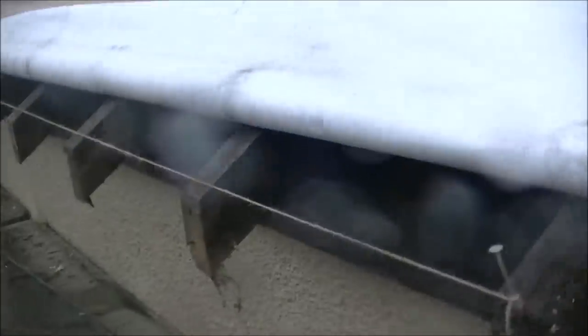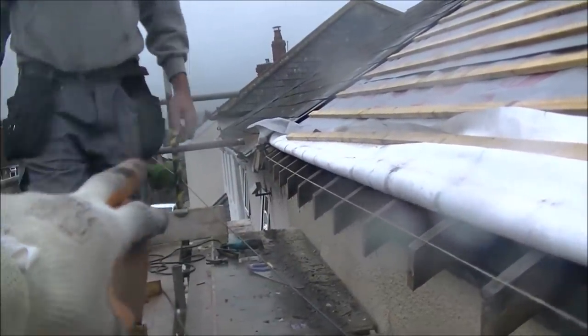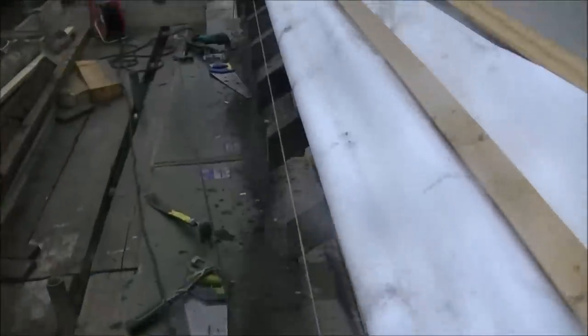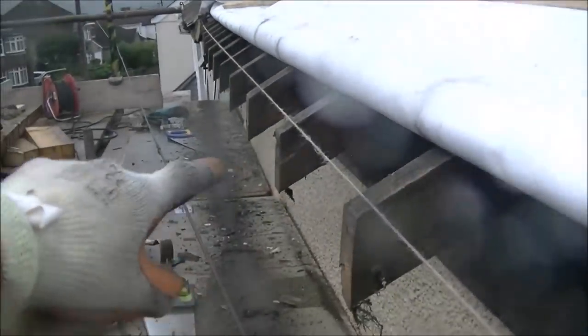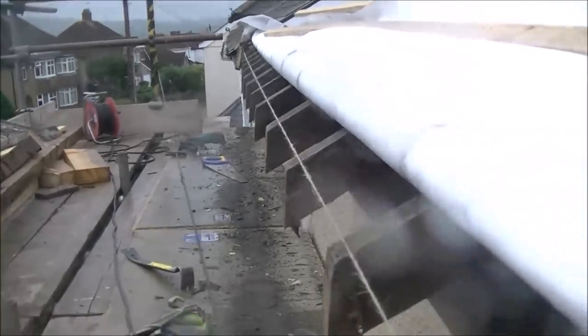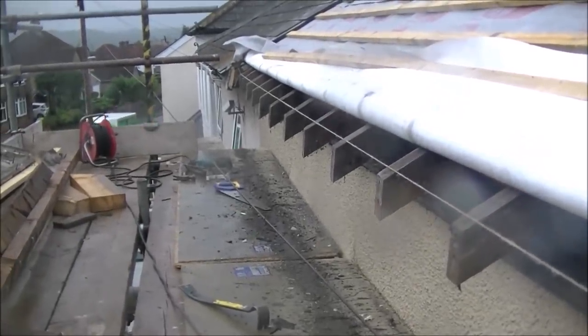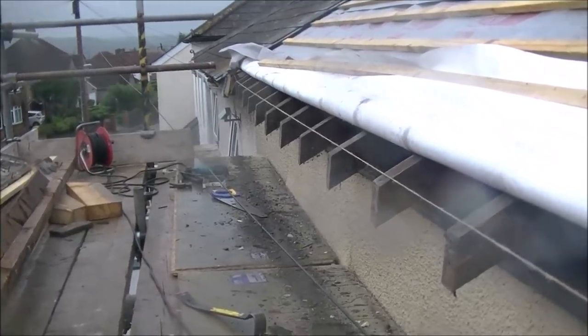We've removed the fascia board and trimmed it off down there — there's one piece going from me through to next door so I cut that over a rafter. We've freed the soffit board, which we just pushed back for now. It sits on the cavity wall at one end and will fix up to the rafters at the other. Where we've done this string line, you can see the bow — at both ends they're level but look how those rafters stick out. We'll cut them in line with the string line, pull the soffit board up flush, get the fascia board on, and screw the fascia to the soffit so it all sticks together nicely. This isn't essential for the loft conversion but I want to do it properly and give the house an MOT so hopefully I won't have to do anything on this roof again in my lifetime.